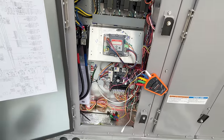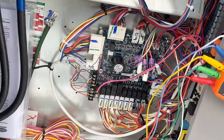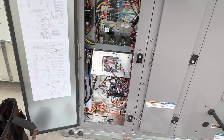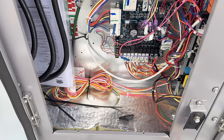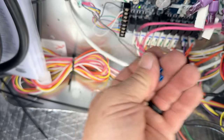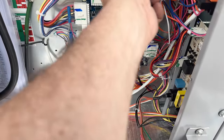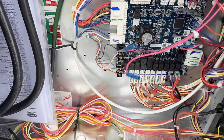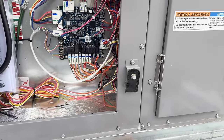Alright, finally something works right. So the two wires — gray and brown — go to the pink and striped pink. It is calling for dehumidification right now. Left them a nice little node in there for that. Got wire nuts on that and can move on. We've got butt connectors on there, which allows me to check voltage and makes sure it's not going to pull off. I like doing it like that — it's something the alarm industry does with little booties. I'll write down here that gray and brown is dehumidification, so somebody comes in later they won't have to go through that.